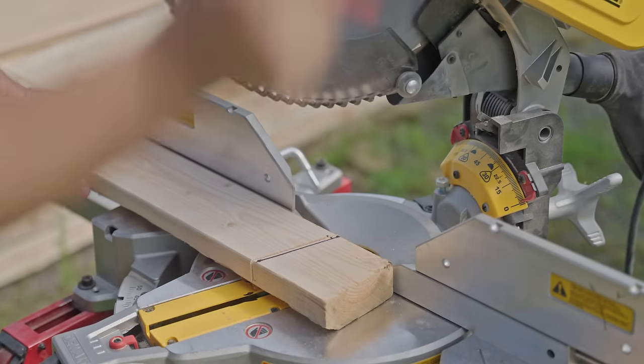Here's our edge of our building, okay? We gotta know our end from our beginning, so we gotta think about our assembly. Now, I'm gonna be wrapping this in Tyvek, which has a 1 millimeter thickness, maybe two, all right? But then we're also gonna be adding, our finish clad is gonna be vinyl siding. And generally speaking, the J trim that goes on vinyl siding, this width here is going to be about 1 inch. Now, because we're gonna have an outside corner, we need to have at least an inch of here.